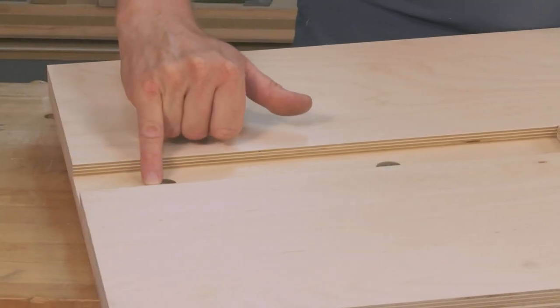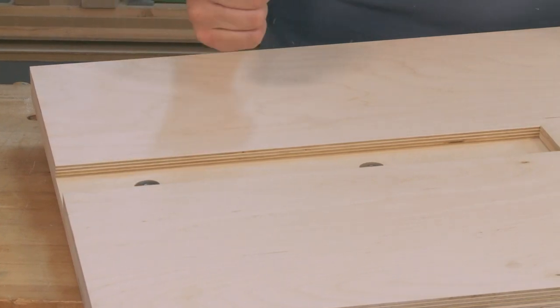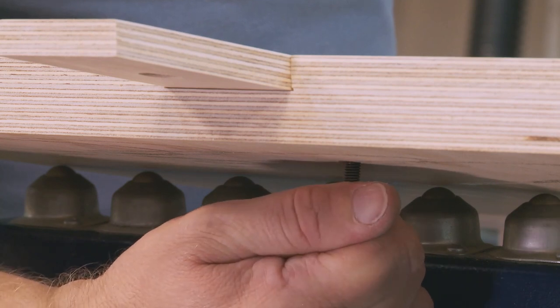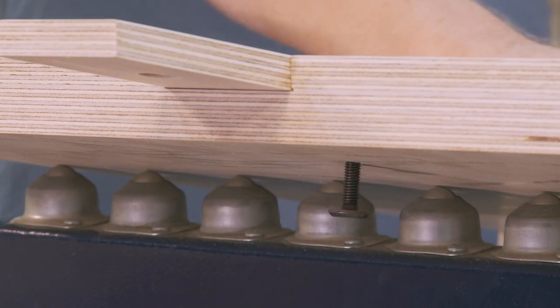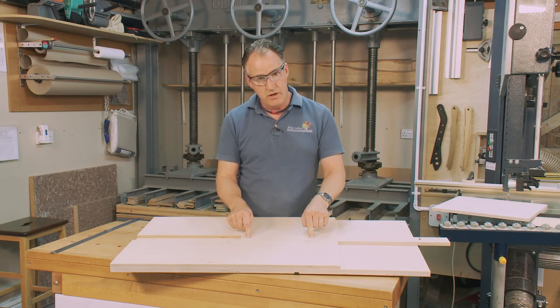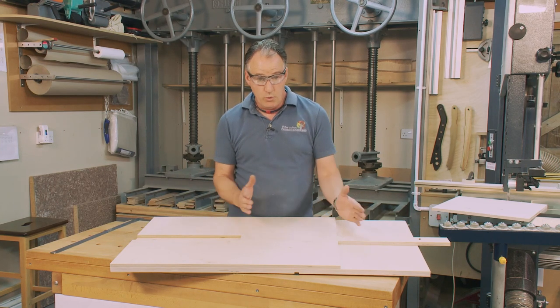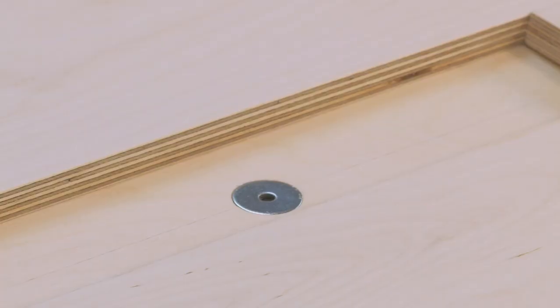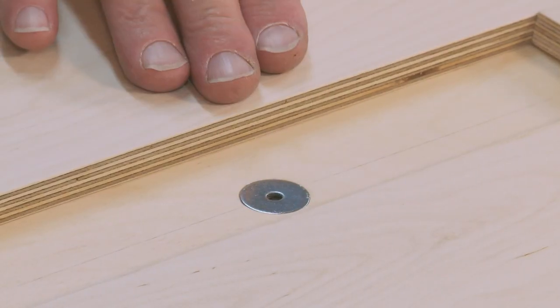There are some washers set in here; underneath there is a screw that I'm going to tighten down when I've got this into position, and that's going to lock this off. If I just put the screw or the bolt up without a washer on it, I would damage the bottom of my slider and possibly it wouldn't slide so well, or next time I came to use it, it would pop back into the hole I produced before - so that wouldn't be ideal.